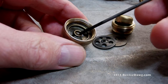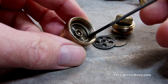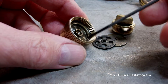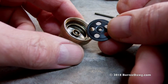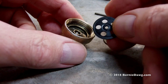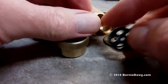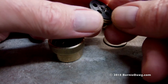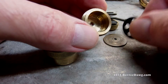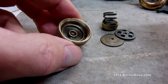This inner raised ring acts to seal pressure from leaving the cap. The outer ring is what the outer cap clamps both the rubber and the brass seals against, to create the seal around the outside of the cap. There's a very nice machined surface on the underside of that outer cap that's going to press down on both the rubber and the brass portions of the inner parts of the cap against the ring.